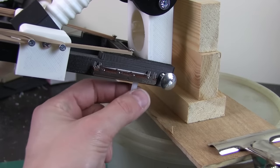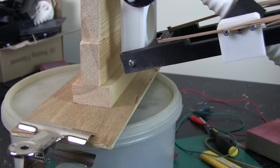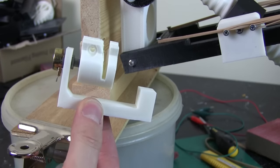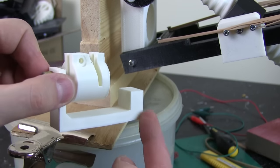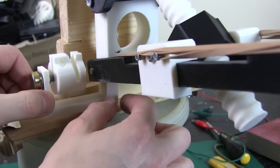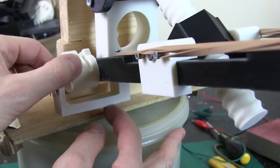I've just mounted the potentiometer — this slide pot with a little bit of sticky tape — and I'm going to make a lever to attach it to the slider. On the other side I'm mounting the pot for the angle. I've got a potentiometer, a thing to attach to the joint, and a part to fit underneath. The piece here will fit to the white part right underneath, and another piece will be solvent welded onto the black piece so it turns as the arm turns.